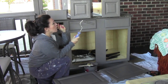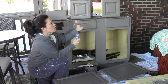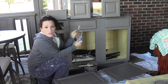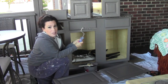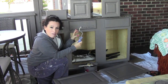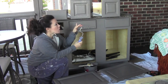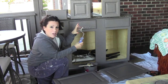If you do want a satin finish in your kitchen, do your two coats of paint and then add two coats of latex-based satin finish polyurethane on top. You don't want to use oil-based polyurethane over a paint finish like this because over time it will start to yellow and really interfere with the coloring on your cabinetry. So go ahead and get the latex version if that's what you'd like to do.